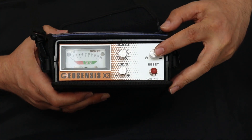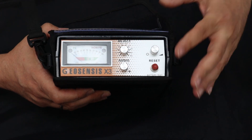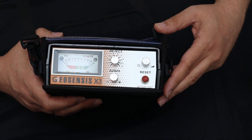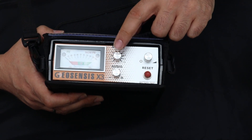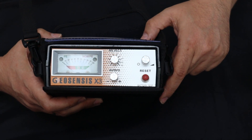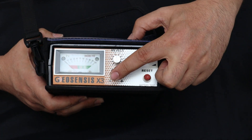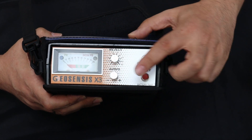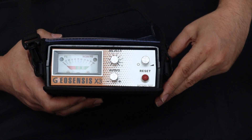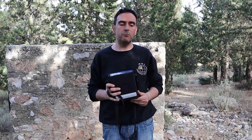From here we can power on and set the audio volume. This is a simple metal rejection control — for example, we can knock out thin metal objects like aluminum foil. This is most useful with small round coils, because with the big frame we simply don't detect anything smaller than a fist size. This knob is the sensitivity of the detector where we can set the ticking sound.